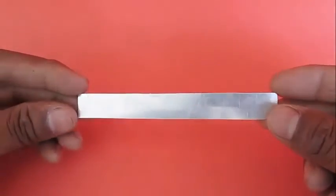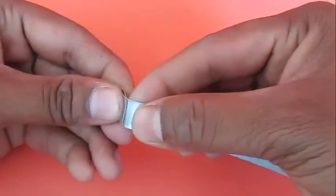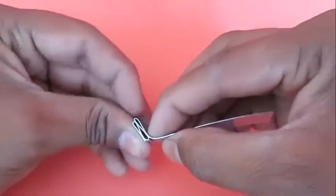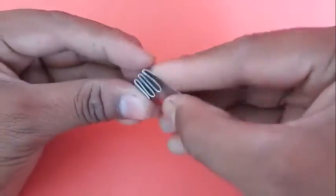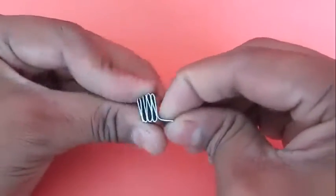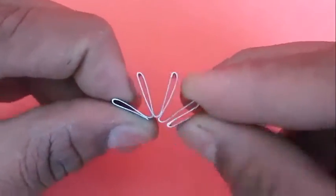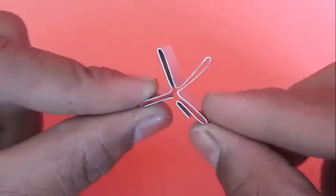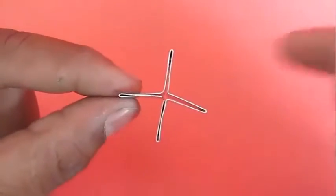Now this is a thin aluminum strip and we are going to fold it several times to make a 4-blade fan. This is the vane which is going to spin inside this film can and drive the water up the pump. So this will be the fan of the pump. Phase it out into the shape of a flower with 4 petals — this is how the fan is going to look like.